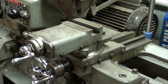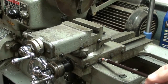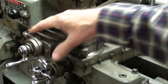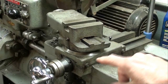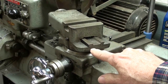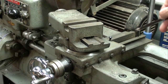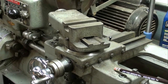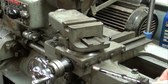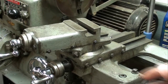We are now standing at the 12-inch Atlas Craftsman lathe. This machine has two machine slides — this is the cross slide right here, as mentioned in many of my other videos, and this is the compound rest, which is also a machine slide. They glide on dovetails, and you can see where they get the name for the dovetail. We've got another set of dovetails over here; I've removed the guard from that and we don't want chips to get in there. As these parts wear, we can adjust them by tightening up the gibs, which is done with one, two, three, four screws with lock nuts on them. On the compound there are just three.